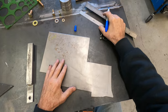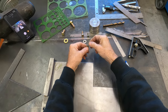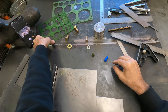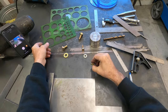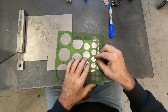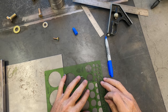Now for the holes, we're going to do four different size holes. The way I like to do it is start with all your hardware and know what kind of hardware you're going to use — four different size fasteners going in the corners. I have these round templates; I like to use those for radiuses and various things. We'll start out with a quarter inch, and we want to have some edge around the quarter inch washer, so we'll use the appropriate hole for that.